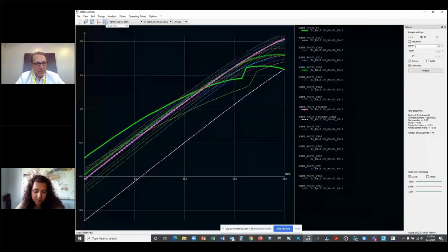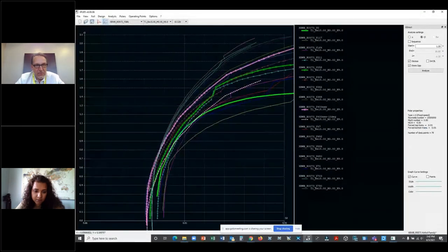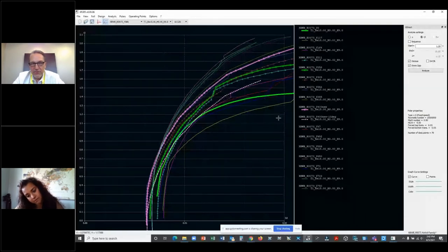And when I go and look at drag, here's what I want to see. Most airfoils, if you guys don't know this, here's a piece of gold. I'm giving you guys gold. I pick 0.02 for a very particular reason. Somewhere between 0.017 and 0.025 is where all airfoils without flaps and slats stall, no matter what. And that's funny. All the Reynolds number effects are captured in that drag coefficient.